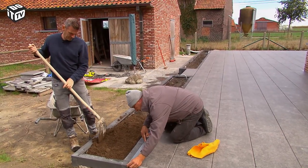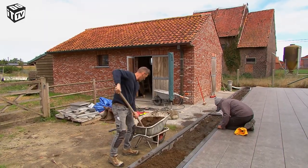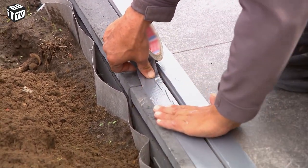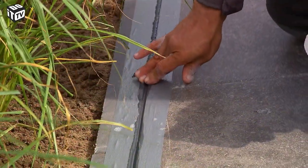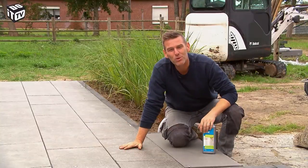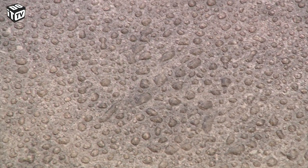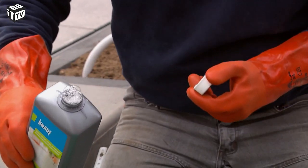Meanwhile, the flower boxes are also being filled with potting soil. We will plant some hardy grasses that provide a nice contrast with the grey of the tiles. On this side too, a connection point needs to be filled — between the tile and the flower box. Tape both sides, then fill this seam with flexible sealant and smooth it. If you still have any cement residue, you can remove it with a cement haze remover. Thanks to the tile coating, dirt, grease, and green deposits stand no chance, and you simply maintain it with a bucket of water and natural soap.